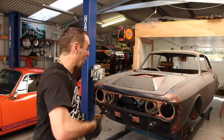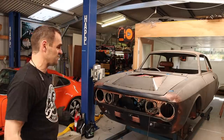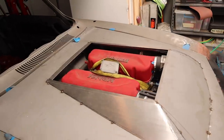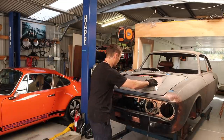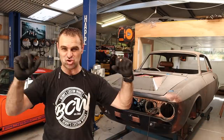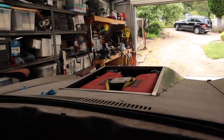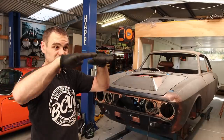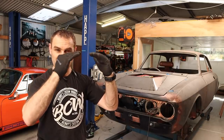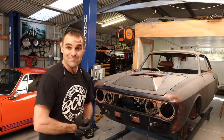That was a lot of work, but it was quite rewarding. I'm really happy with the result — it's not a massively offensive bonnet bulge. Okay, yes, it is pretty big, but it had to be — it's got a very big engine for a little car. I'm really happy with how it turned out, happy with the curve, it's nice and symmetrical, and basically the shape I want. It's got the reinforcing of that double lip which I will weld all together, and that will give it extra structure around the top edge. When I do put that perspex cover in there to show off the Ferrari engine, it will be solid. Just giving it that slight curve will also help add strength — if it's perfectly flat it can flap a lot, but that little bit of curve gives it a lot more structure so it shouldn't flap in the wind. It looks a bit more natural giving it that curve. I am stoked.